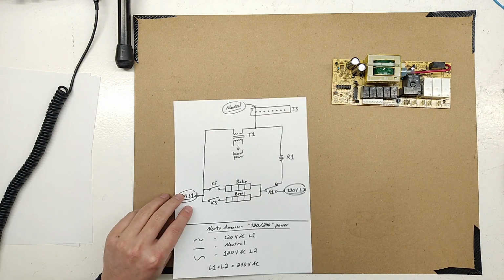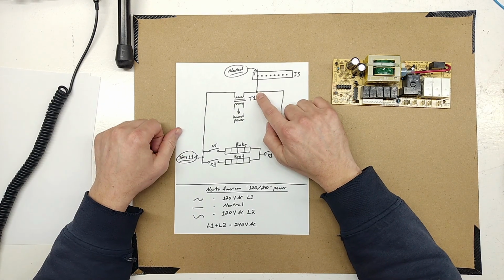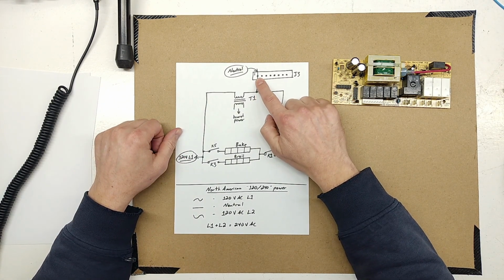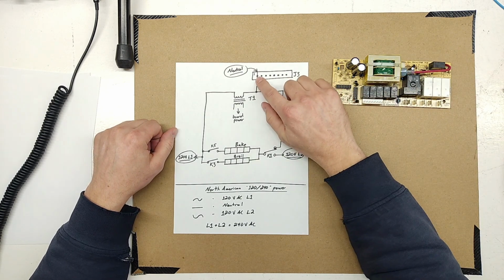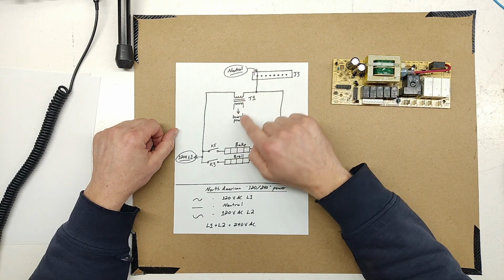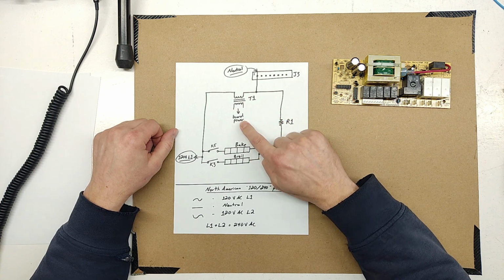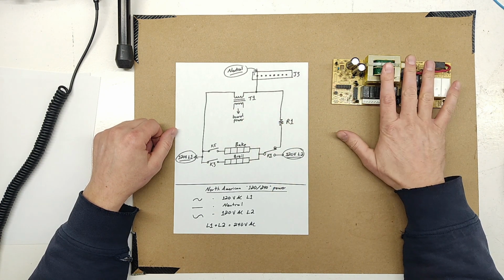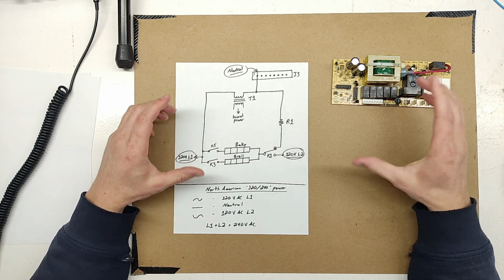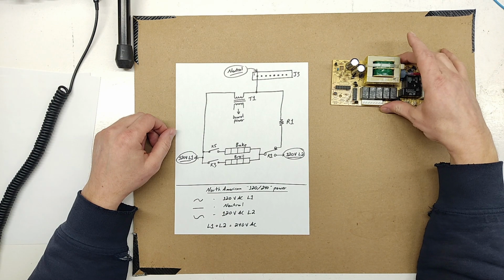As we saw, before I go there, the solder joint here on J3 is breaking, meaning it's cutting this transformer off from power. Which means the entire DC rail for the power board, and this also runs the display. This transformer and its power supply runs the display in the entire front panel.